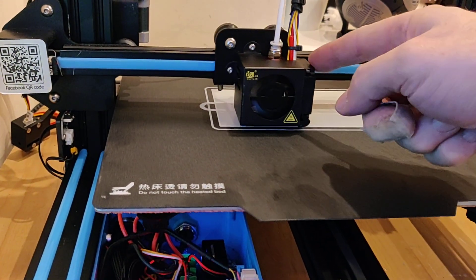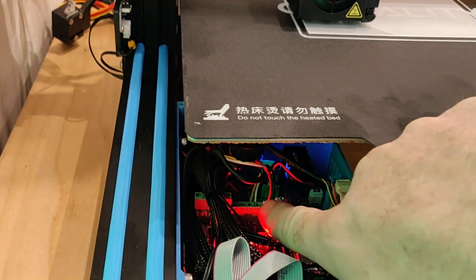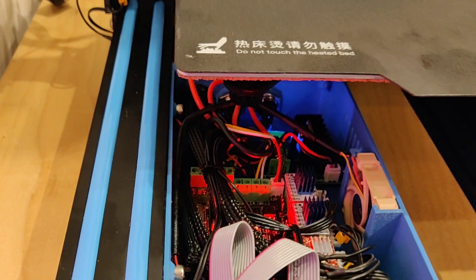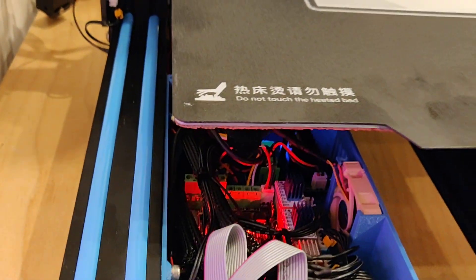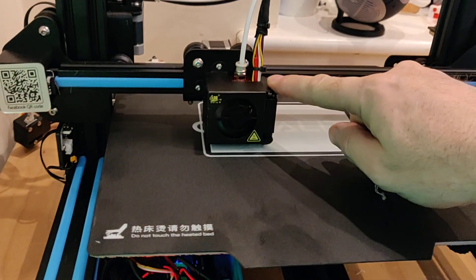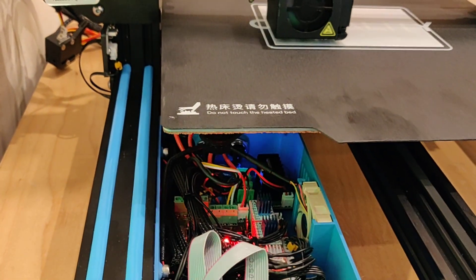These are the original fans — your cooling fan and your extruder fan. The extruder fan is mapped to the D7 port, which is the second extruder port that's usually blank, and I've throttled that to PWM 70. The cooling fan — the black and red wires — is throttled to PWM 60, because it's a 24 volt system and these are only 12 volt fans.